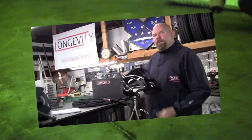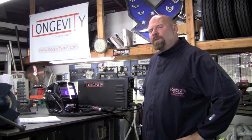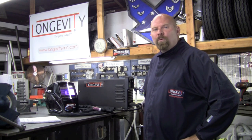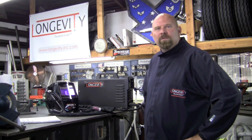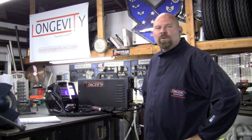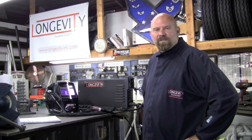Now that I'm done welding I'd like to share my thoughts. Wow, what an incredible little welder — you're really fooled into thinking you're using a much larger welder than the tiny package sitting in front of you. Big welder performance in a tiny portable package. I'd recommend this for people in the construction industry, installers, mechanical maintenance and repair, mold manufacturers, pipeline industry, and even the garage builder or hobbyist. Keep in mind it is an air-cooled torch rated at 40% duty cycle at 50 amps. Mine is going to spend a lot of time with me out in the desert at the races in the pits.